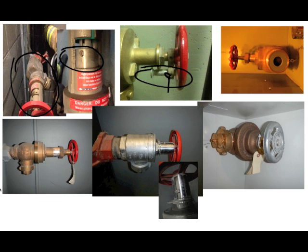This next one to the right has an orifice plate — you can see it right here — and that plate is designed to be popped out. If we can force it out by sticking a set of channel lock pliers, or the pick of our haligan, or an axe or something like that, we can pry that orifice plate out of there. It's set at the factory, it's not adjustable, but it is defeatable.